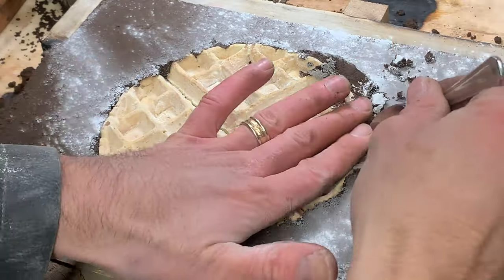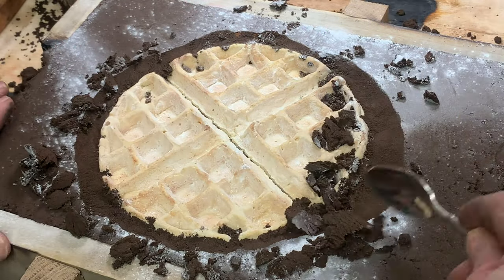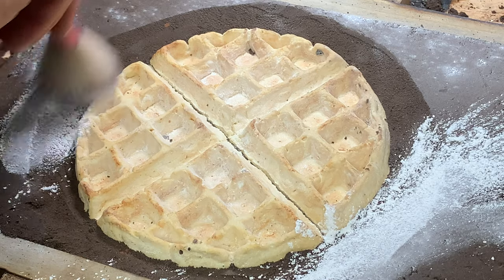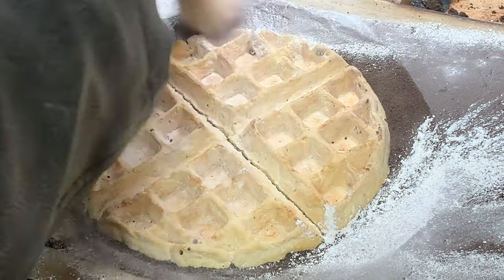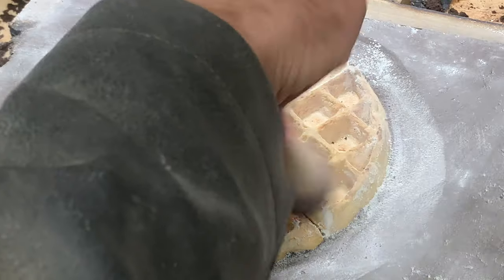There's a little bit of an overhang so I'll dig down to the seam of the waffle iron just so the waffle will not get trapped in the sand and it'll come out just like it would when you're baking it. I'll spread some more powdered lime over it just to make sure the sand doesn't stick to itself and I can take both halves of the mold apart freely.